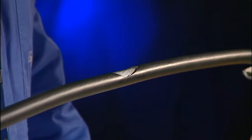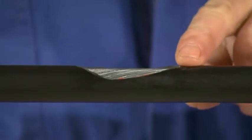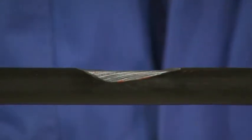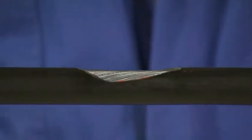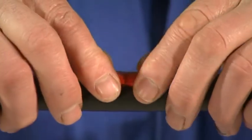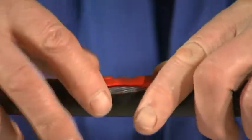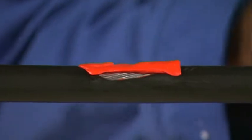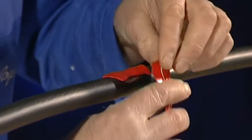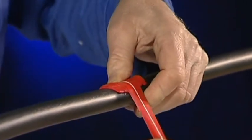To illustrate the method used to apply Alpha, I'm going to repair this damaged cable. As you can see, the over-sheath has been scraped away by a spade, and if it was left like this, the cable would fill up with water. Alpha Smooth is basically used as a filler, and it's squeezed into the crevices when you wrap the tape around it. For electrical connections, the tape is applied in two passes. The first pass provides the waterproof seal, and the second pass gives additional protection.